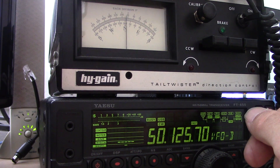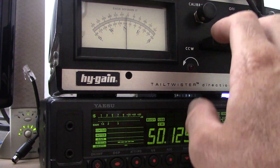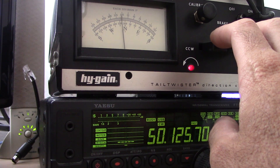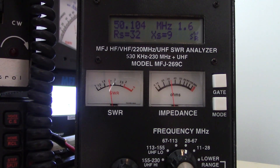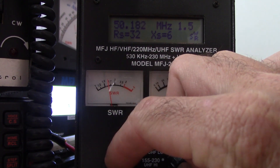I'm going to rotate it now to where you can see the noise comes up from the power lines - listen carefully. Facing north means I'm just off the edge of the front lobe from that power line. Now if I turn it back toward the west so I'm off the side and back side... it gets quieter. So it is getting some of that noise rejection there - it helps me out with those power lines I need to get fixed.